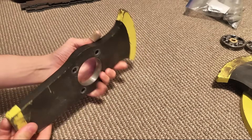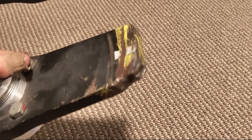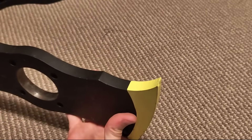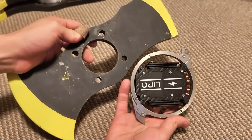There are three swappable weapon bars in various stages of wear. One of the lighter bars is completely rounded over, but this can be dealt with by regrinding the tooth and rebalancing based on the lost material. The heavier, aggressive bar is mint and will definitely be integrated into the new design. I believe everything is 16mm thick Hardox 450.